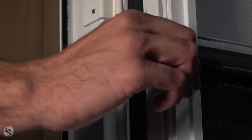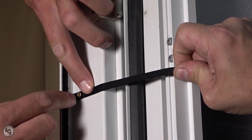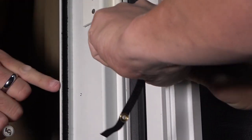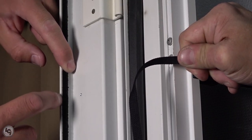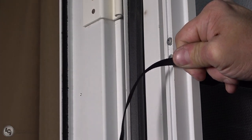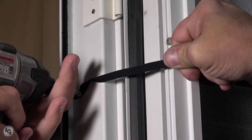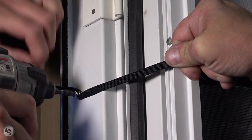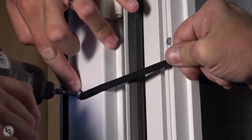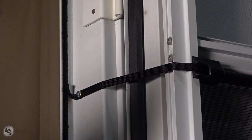To properly secure the webbing, pull back the webbing — it'd probably be best if you had someone help you, because this is going to have a lot of tension on it. We want to make sure that we attach the sheet metal screw half an inch from the frame of the door — not including the weather stripping, but half an inch from the edge of the frame. The other option, instead of using the sheet metal screw, is a pop rivet that comes in the package. The sheet metal screw will work just fine though. As you tighten it down, it may want to wrap around — you don't want that to happen. It won't have any real adverse effects to the system, but once it's attached, you have all this tension, and when you let the screen door go, it's going to go ahead and close for you.